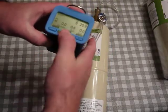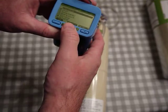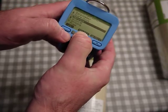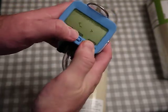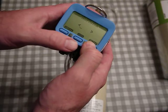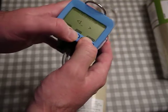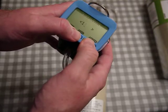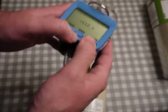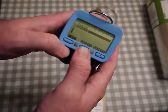I don't want to use Auto Cal here. Instead I hold down reset to get into the menu until I reach 'service.' I hit 'select' and enter a special code: this button moves you across, and this one increments the numbers. I enter 1-1-0-0, which puts me into the service menu. Then I navigate to the sensor I want to calibrate.